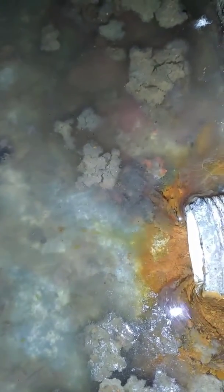You can see the water draining — that's the water in the pan. I got that pipe unclogged; it had a lot of algae in it. I took this access panel off to get to the drain lines. This is the primary drain line and this is the secondary. I want to make sure that the primary was clean, so I started by removing the filter cover.